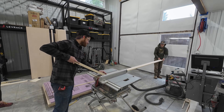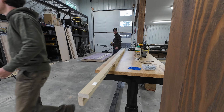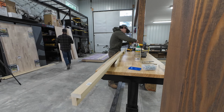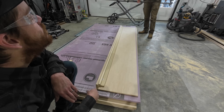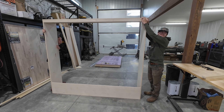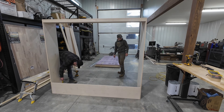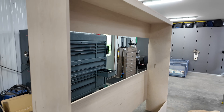What felt like 100 pocket holes later, it was almost time to assemble the wall cabinet. We ripped some poplar down into 1x2 strips, ran a bead of glue, and used the nail gun to pin them into place at a right angle before fully securing them with screws. This piece is going to trim out the front upper section of the wall cabinet so there won't be any exposed fasteners. Now it was time to assemble our first cabinet — this is where all those pocket holes come into play — and we fully screwed the box together. By the end of the day, we had our first cabinet complete.